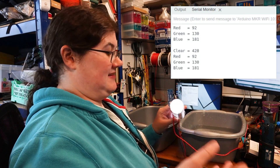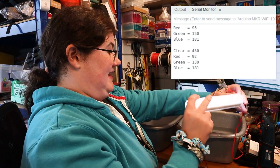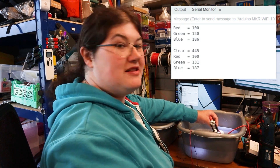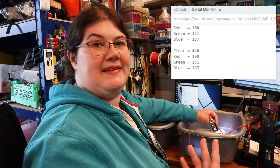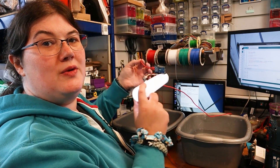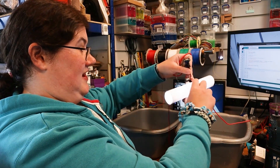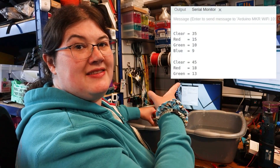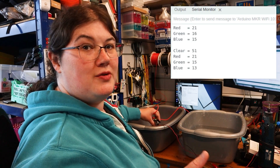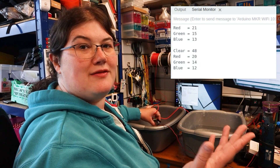There's some red, some green, and some blue — I think that's just picking up the color components of the strip light. Now if I dip it into the clear water, you can see there's still a high clear and high red, green, and blue component, so it's pretty much the same as when it was in air, which is what I'd expect because this is clear clean water. Now I'm going to put the pipe in the murky water — simulating what I'm thinking would happen in a river, with the pipe in the river taking the flow through it. We can see on the serial output that I've got a much lower clear result. With just water and coffee grounds mixed in, it still has some clear reading but it's about a tenth of what it was in the clear water.